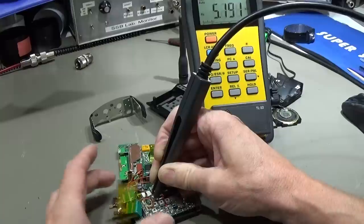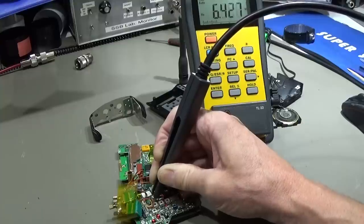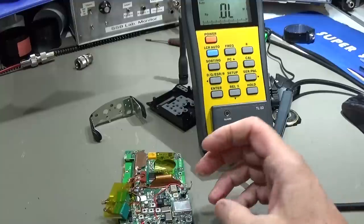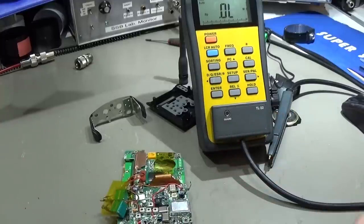So you see, while I'm testing, we are feeding the capacitor with current, and you see, while the current is going through the capacitor, our value is increasing. And if you're a little bit familiar with ESR testing, you know that the values we expect are normally around an ohm or even lower, 0.2 or 0.02 ohms. So that is what you normally expect, and not 6.3 kilo ohm as we have it here. And that is with all these little SMD electrolytic caps we have here on the board, and that is the reason why we really need to switch them out.